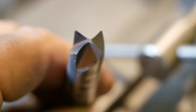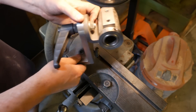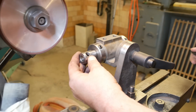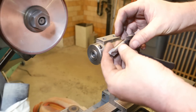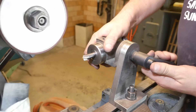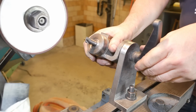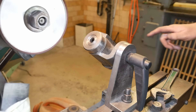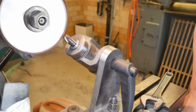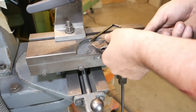With the four flutes now ground I no longer need the dividing head. From here I can divide off the flutes themselves, so I'll switch now to the normal work head. Luckily I've got a collet bush for half inch, so that's good. I want a 90 degree countersink so let's tilt this up to 45 degrees. Nope, that's not going to work because I've got a height problem again. So I'll set that back to zero and swivel the whole table.